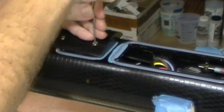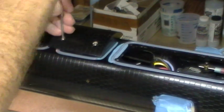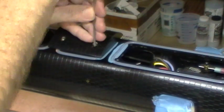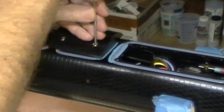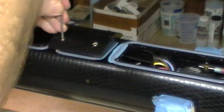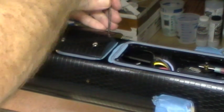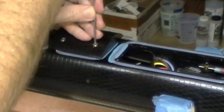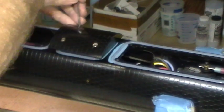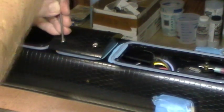I'm going to cross over to the front here, cross over — basically forming an hourglass figure — cross diagonally, cross to the next front screw, diagonally to the back screw, only a couple of turns at a time. It's very important that no screw is turned too many times, as that could actually crack the threads.